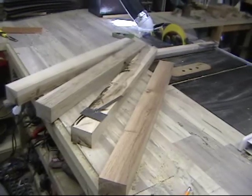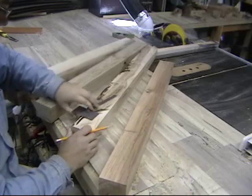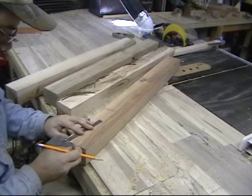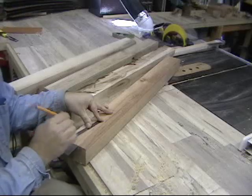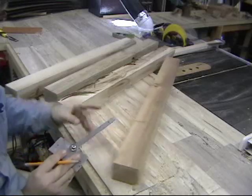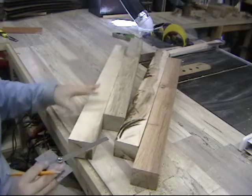The stock we're going to use for the legs on our bench isn't that heavy-duty — it's only about three inches wide — but we're going to make up for it with joinery. Plus, the bench isn't that long; we're only going for just over four feet, so we're going to be in good shape. This will be very stable. Ten degrees. I don't care what all these people say — do my dovetails the way I want to do it.